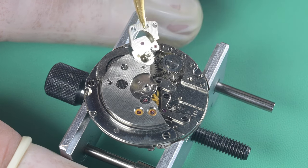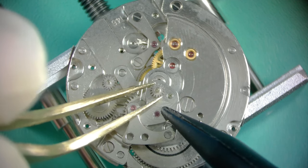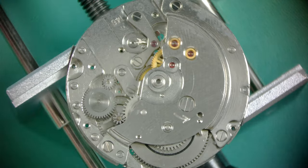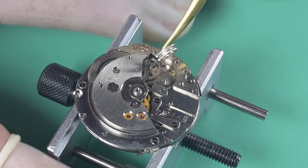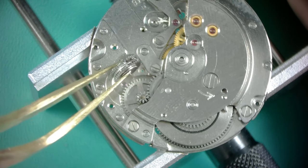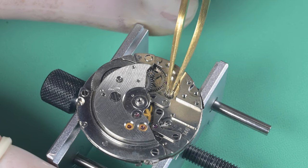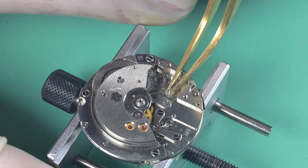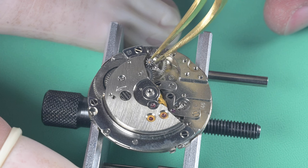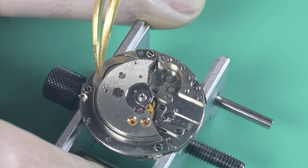This automatic winding works has a really unique design. There's a second reverser idler wheel, a differential wheel, and reduction wheels. I'm thinking of the differential wheel in the same context as a more traditional Swiss or ETA-style movement with reversing wheels — it functions the same way but is completely different. I pull out the first reverser idler wheel, then there are two reduction wheels, one underneath the bridge plate. The ratchet wheel on this movement is underneath the bridge plate, which is a bit different.